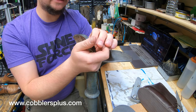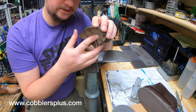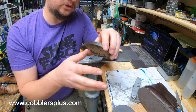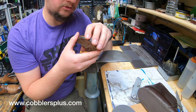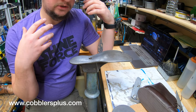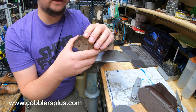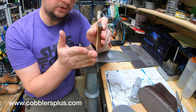The problem with the adhesive is it has a cure time of roughly 15 minutes. We use a brand called Jet Set, and the cure time is 15 minutes before it's usable, and that's normal. Some glues may take about 30 minutes to an hour before you can actually start working with the material again, like sanding, trimming, cutting it, or anything like that, without the bond coming apart too easily.